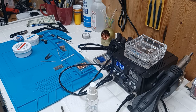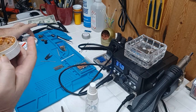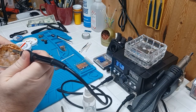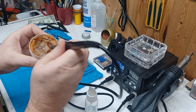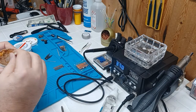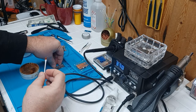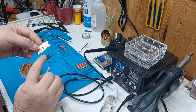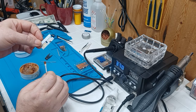If I was to use this hard flux, what I used to do is take it, melt a bunch of it, get a nice puddle of liquid, then take that and dab it on there and smear it to whatever I'm going to smear it to. Now I've got my flux on there — it's etching and cleaning that metal and doing everything a flux should do. It works, but it doesn't work nearly as well as the Radio Shack stuff does. I strongly recommend anyone who's going to solder get the Radio Shack stuff.